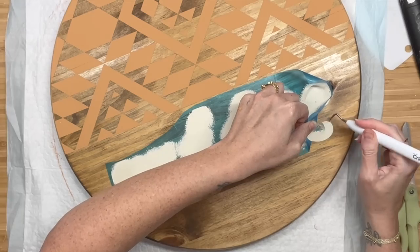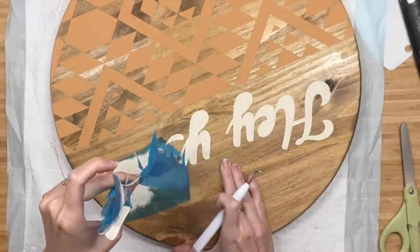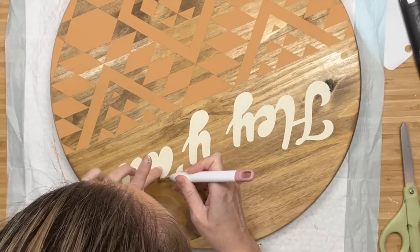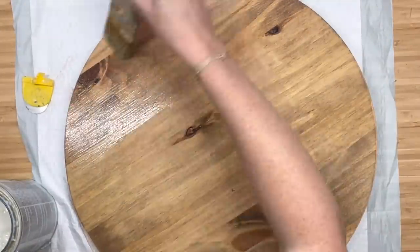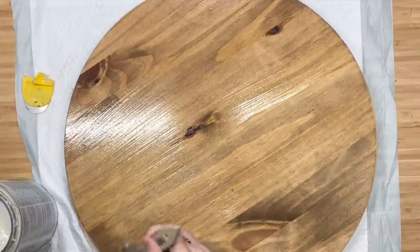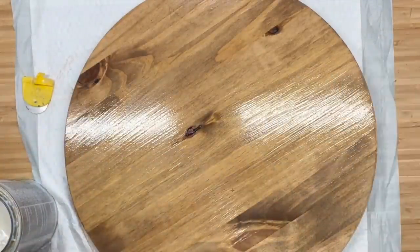After that dries, we are going to peel that off. Do you guys see that wood round? No bleeds whatsoever. I love this wood round so much. Once I'm done with this — and you can see when you weed it with the clay-based paint, there are no flakes that come off. Now we're going to seal our wood round. I am using water-based spar urethane — this is Varathane. It is again in my Amazon store link, or you could get it at hardware stores. You want to use spar urethane because it protects against the elements — humidity, UV rays, and all of that.